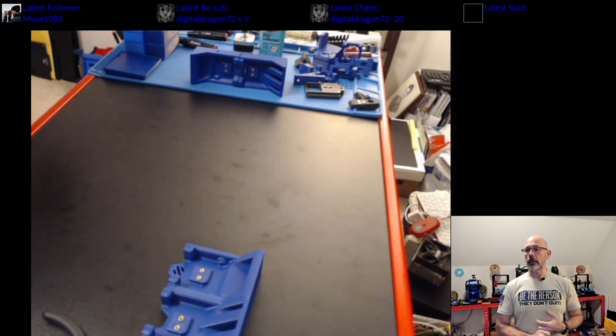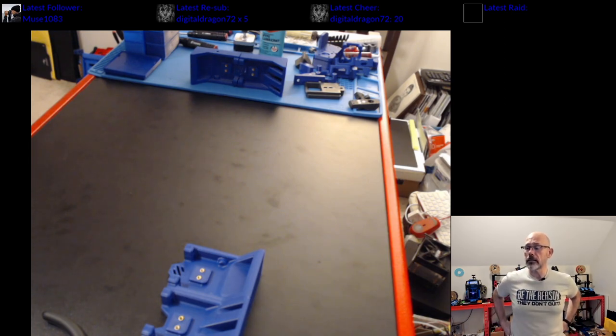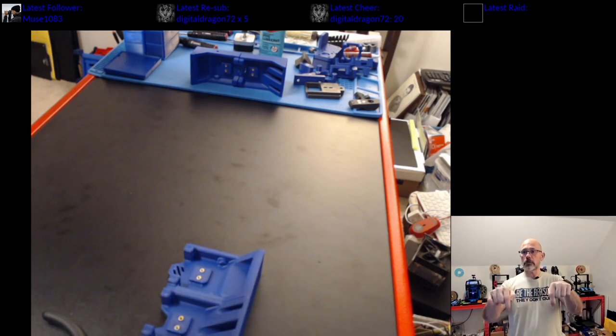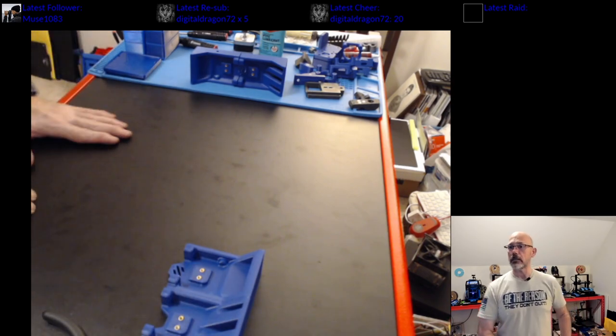And then on the Mercury, which is the Ender 5 Plus turned into a Zero G box, which has a triple lead screw for the bed, being able to do the Z tilt adjust as well is something that helps, because even if you only have two lead screws, you can still get it leveled to the gantry itself. And then it makes working the bed a little bit easier as well.